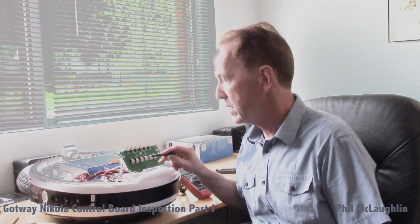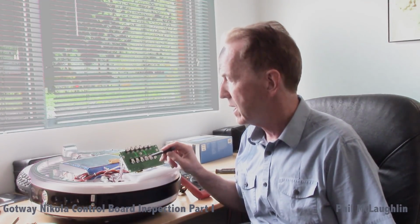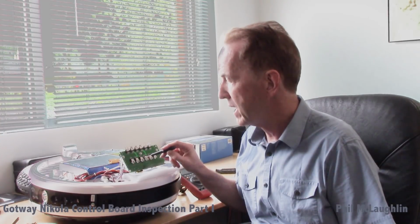If we look carefully here, these are the affected MOSFETs, these two that we're looking at right in the middle here. And there was actually some contaminant also on these others, but these are the two historically we've seen that had problems. Now, interestingly enough, when we actually examined this closely, I was surprised to find out that there was no glue present on the metal surface of these tabs whatsoever. This was completely clean. I could take an ohmmeter on this and demonstrate that this is just bare metal.